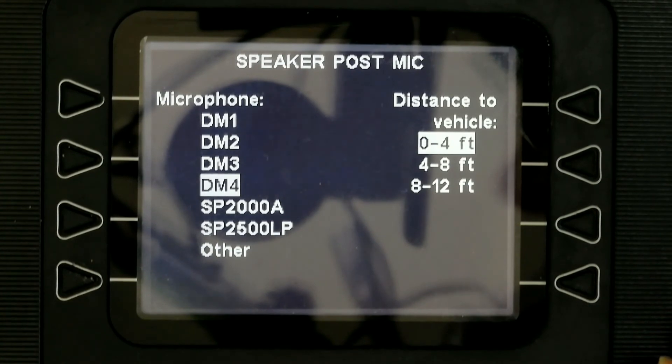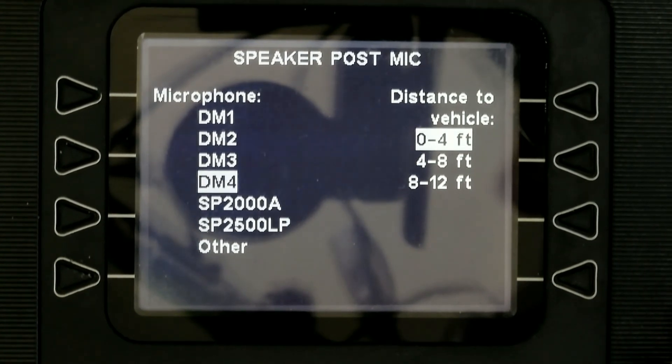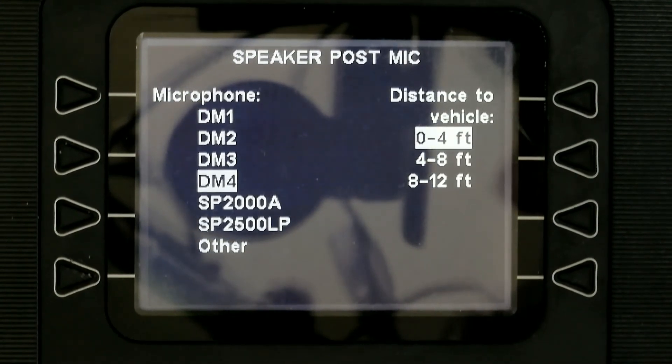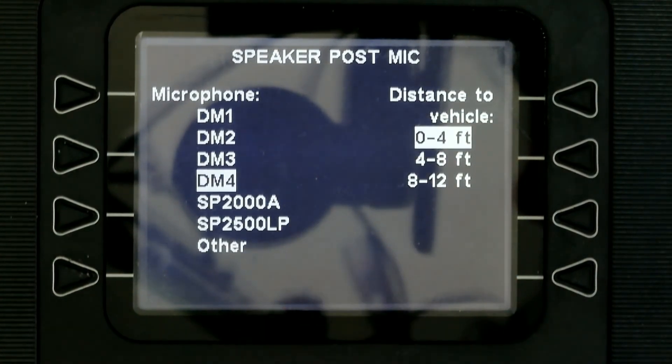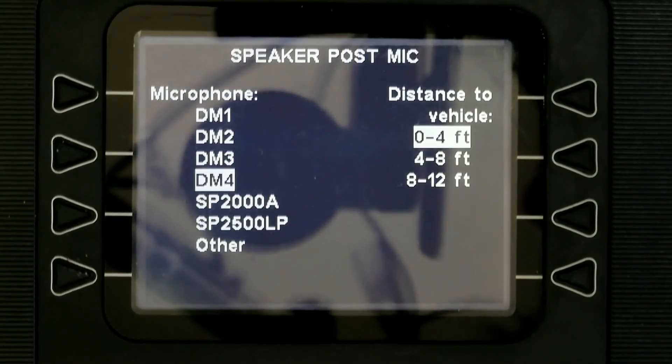The difference between these microphones is the following. Some microphones are dynamic — they use a coil and a magnet — and some are condenser microphones. Dynamic microphones do not require a DC voltage to operate; when sound is applied, they generate a very weak alternating current which gets converted to sound waves in the amplifier. Condenser microphones, on the other hand, require a DC voltage to operate. That's why you have to choose the right mic — you cannot choose the incorrect one and expect it to work.